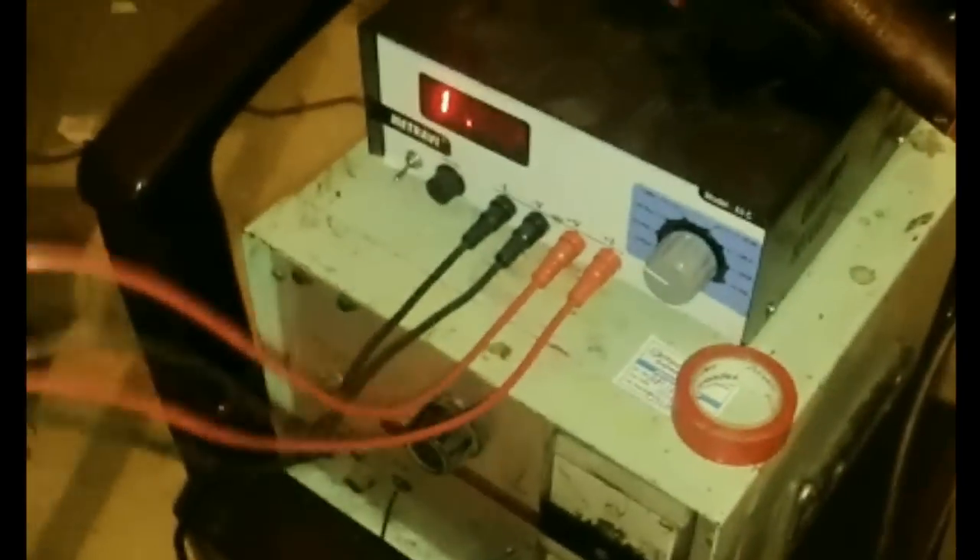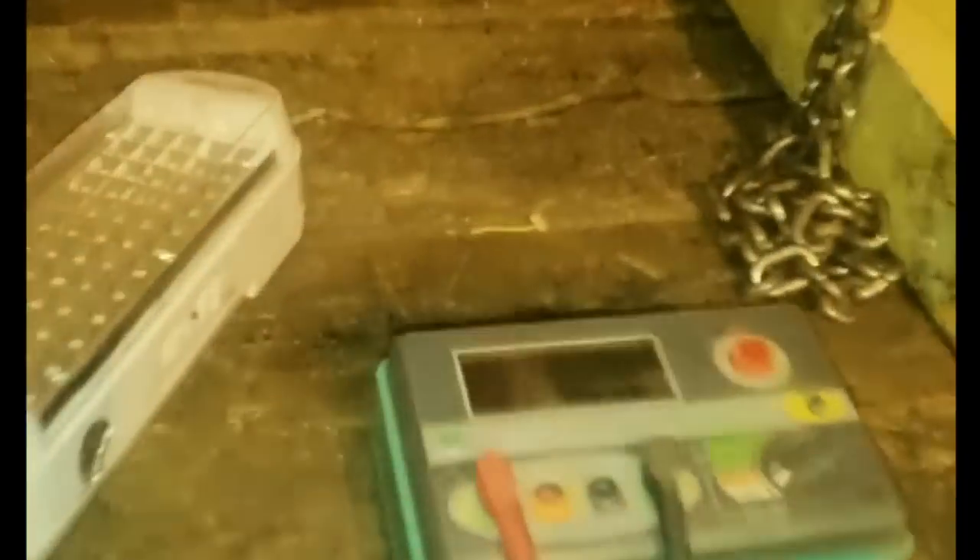We prepare the test result sheet and pass it down to the client. We have already done testing for resistance — micro-ohm resistance — plus the phases, and we have recorded all readings. We use a micro-ohm resistance meter; it has to be balanced within plus or minus 10%, which is the acceptable range. We also use a megger rated at 2.5 kilovolts. Since the flash test already passed, the megger test should not have any problem — and it has also passed successfully.